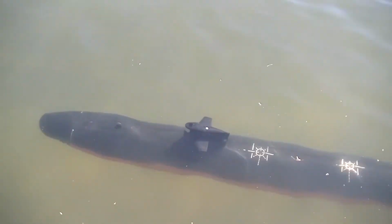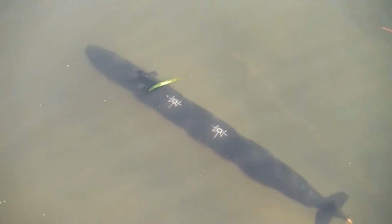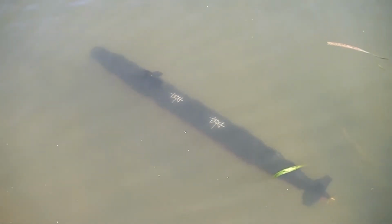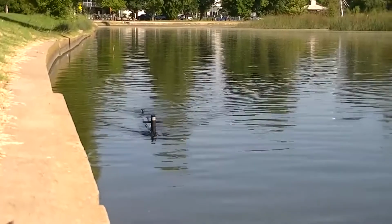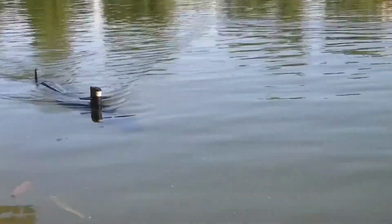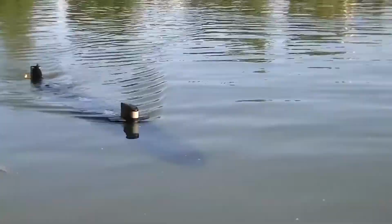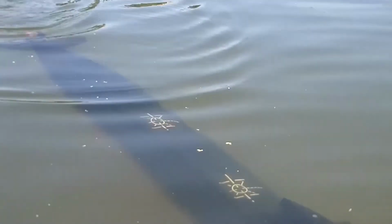This adds to the control, and in this sequence, other than the rudder, the boat is sailing on its own. Of course, it depends that you ensure that your balance with the boat is worked out when you're doing the snapshot, and that you make sure that the boat is nicely balanced. Because if you don't do that, the boat will start to oscillate with this software. The way of solving this is to use some PID code. So if someone wants to develop that and send it back to me, I will be very pleased.